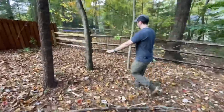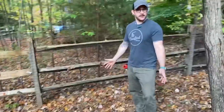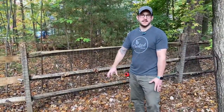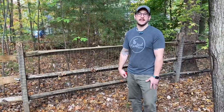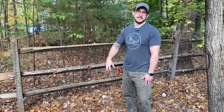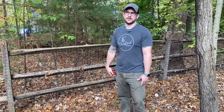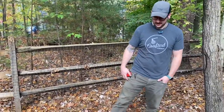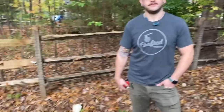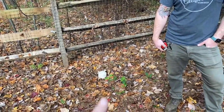These three trees are going to have to go. Here's our clean out — and another fun fact: you can't just tap into the side of a clean out, which I didn't know. Even though this clean out is like six feet long, we can't tap into the side; it has to go all the way down to the actual main sewer. That means the actual sewer pipe is six feet below grade, and that long section is just to clean it out — like if you've got too much toilet paper in there.